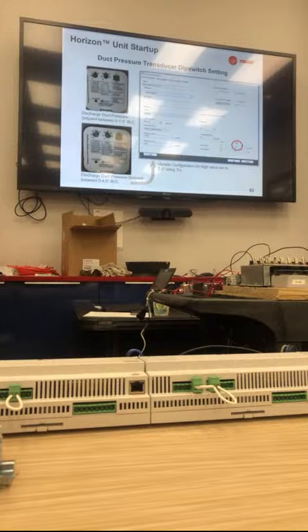The blue ones. Yeah, this is blue also. Same, looks just the same. Or when I go out for the startup, wire them in, check the dip switch, make sure the setting's correct over there. Then, like you said, come back a week or a couple weeks later, the customer calls and the units either run wide open, yes, or it's not doing nothing.